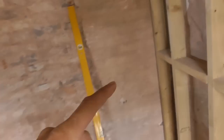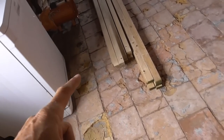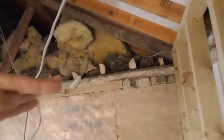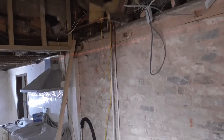What we're going to do today is basically continue around. You can see this sort of disaster zone up here. We're not putting a four-by-two skin on there because the room's relatively narrow, so what we're going to do is batten these walls out using treated two-by-two and two-by-one batten, and I'll run that batten all the way up until it hits the roof line on the side of the rafters, then probably try and build some framing behind it to add support and give something to put some insulation blanket into as well.